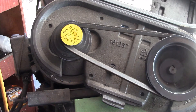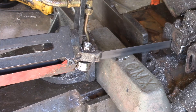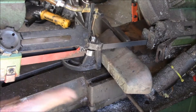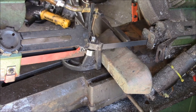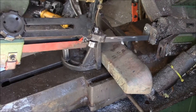I think it's time to give this a try — the blade is running really slow. We've got the coolant running. Holding this thing is actually the hardest part. What I did was take a small scrap of aluminum and machined it down to just the height of the ingot laid over on its side. The ingot isn't quite square, so you can't get enough gripping force otherwise. With this shim it's in there pretty good and it's not going to twist. I'll lower the head by hand and we'll see what happens.